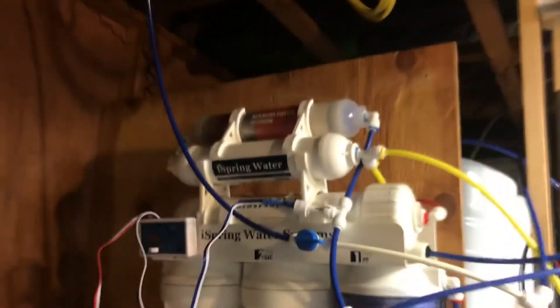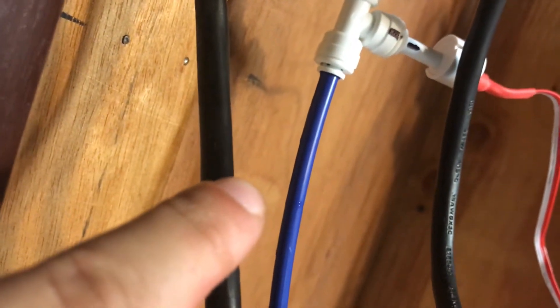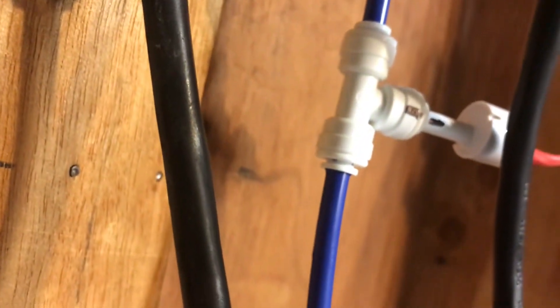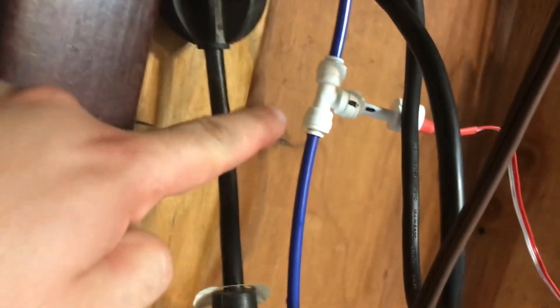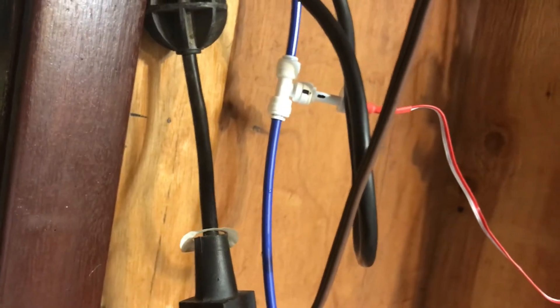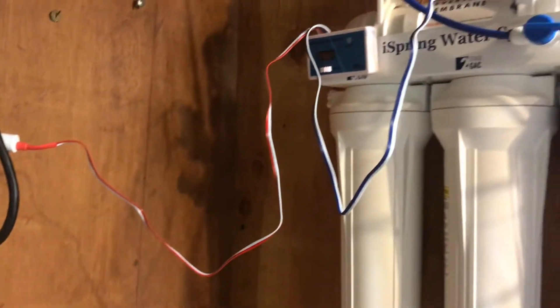It doesn't look like it's leaking. This one's definitely not leaking — nothing there. This other one made a little drip mark but I don't see it actively dripping. We'll check if that drip comes back. If it is leaking out of the bottom, you just push the fitting up, pull it out, cut maybe a half inch off, stick it back in, and see if it seals. If it doesn't seal after two or three recutting attempts, you might be cutting wrong or the fitting itself is bad — I've had that happen before.